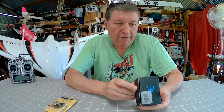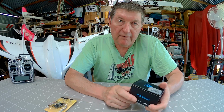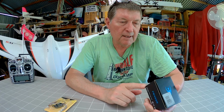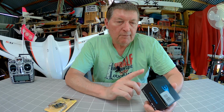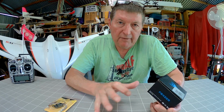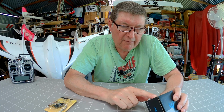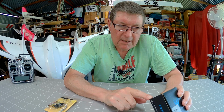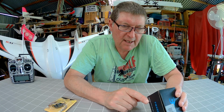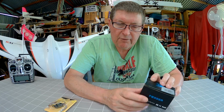And here we have the Foxeer new Arrow. It's a CCD FPV camera. FPV cameras are getting quite smart now. This one has audio, it has a microphone, as well as an inbuilt on-screen display, which can show voltage and time elapsed and a bit of text down the bottom as well. It has a wide input voltage from 5 volts to 35 volts DC. It's the HS1190 1/3 inch Sony Super HAD 2 sensor. This one comes with a 2.8 lens, it's NTSC and infrared blocked.